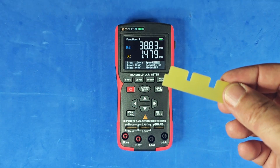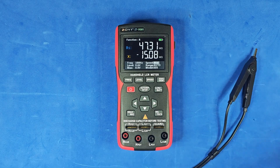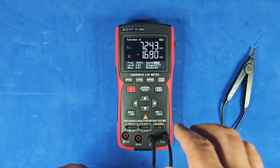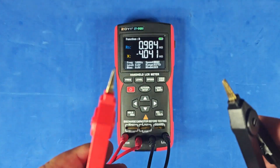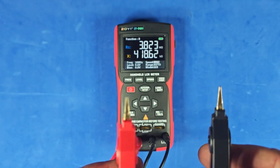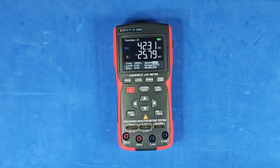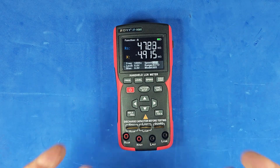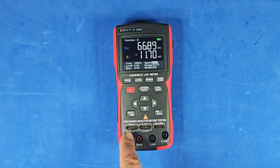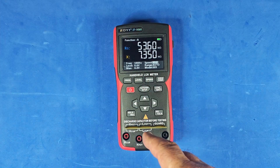Now let's go back to that small plastic piece. This instrument features a 4-wire input — the sensing and current source connections are separate, which is why we use a Kelvin cable. The current from the source flows through one side of the clip, while the voltage is sensed directly at the component lead by the other side, allowing precise resistance calculation. You can also insert component leads into the slots on the device, which still provides 4-wire measurement. When no component is inserted, the spring contacts touch, so when using the Kelvin cable, you must insert the plastic separator to prevent a short between the connectors.